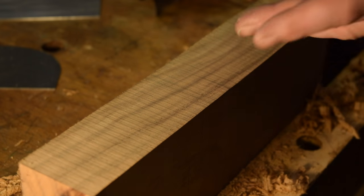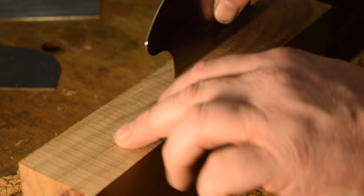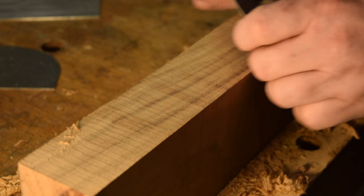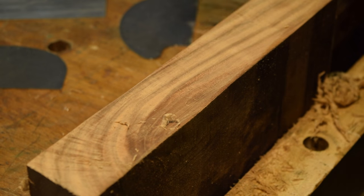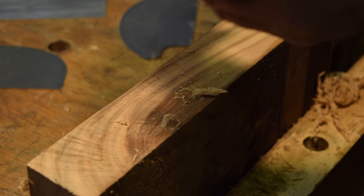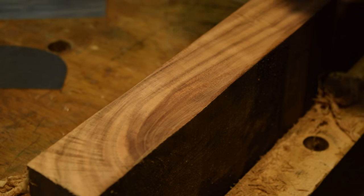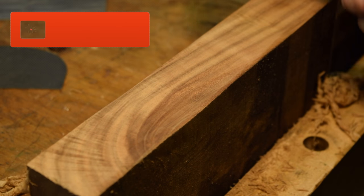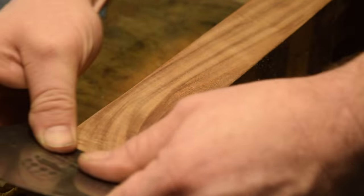When you're trying to remove marks left by a saw or another tool, you're going to have valleys, highs and lows. The best way to fair those out — much like a plane takes off the high spots — is to skew the scraper to remove the highest spots first. Doing it in one direction and then coming back and skewing in the opposite direction, you can help to fair out any highs and lows and start to produce a plane surface. What you're looking for is a shaving, not just sawdust — if you're getting sawdust, that means you're dull and need to retune the hook. When you're getting close to the finish you like, you can tilt the scraper down further and take a lighter cut — still getting shavings, but they're much lighter.